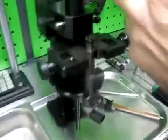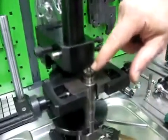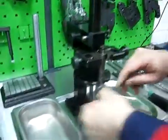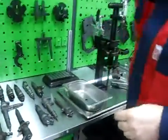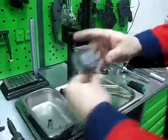With the help of the axial clamp there is no risk of breaking the pin, so we can safely remove the pin. Then we can measure the needle valve stroke.